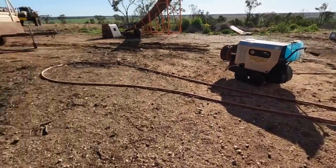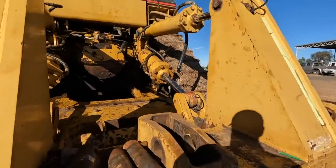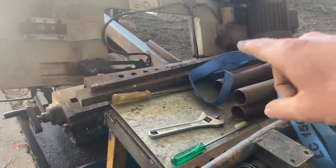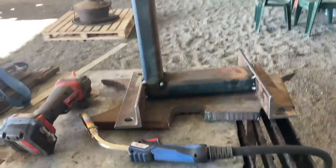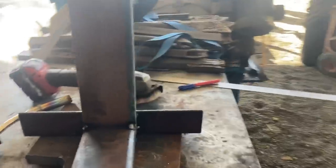That's probably going to be my job today - just making this jig and see how far we get with that. On top of the transmission, there's a square plate and it's got four holes. I'm going to get a bit of 2x4 fairly heavy walled steel and just weld that up to there. Then from that, we're going to have a bit more coming out on an angle going up. We're a bit further along. I keep telling myself I'll do a time lapse but because I'm making it up as I go, I'm just adding bits here and there. I've got the holes drilled, fairly well oversized just to allow for a bit of warping when I finish welding it.